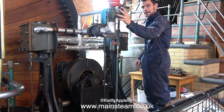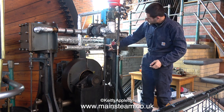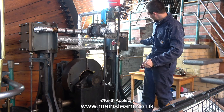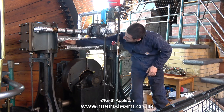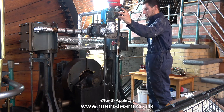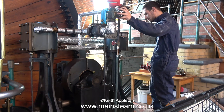This engine, these barring engines, were quite often very Spartan, and they took a lot of abuse. For some reason, this seems fairly common. This one only has bottom-end cylinder drains, no top-end ones, and no chest drains. So when you start it, you have to be extremely careful and judicious and make sure all the water is out of it before you close them up. But sometimes when the engine took a bite and the thing was falling out of gear, these would reach 500-600 RPM or even more.